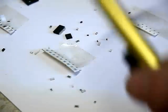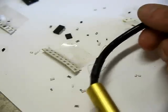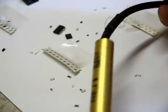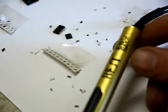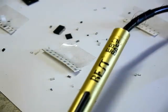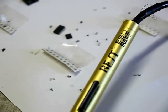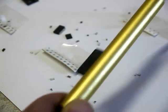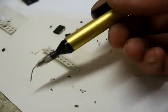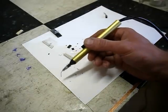One other addition you can do — that I did — is run some magnet wire down the airline and connect it to your grounding system. Now that you're grounded you actually are ESD safe, instead of just claiming to be ESD safe with no discernible ESD protection measures.